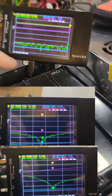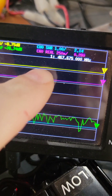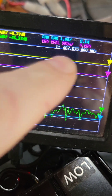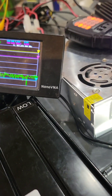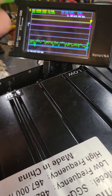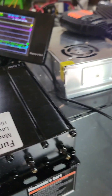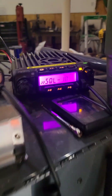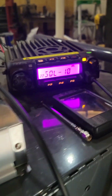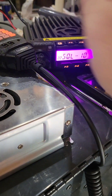On the low port here I've got channel zero going out and coming in. It's transmitting a signal out on 467.675 and I'm picking it back up on this side — that's just so I can zoom out and look at the tuning if I want. The antenna is hooked to a receiver over here. The squelch is at 10 and it's occasionally breaking squelch.